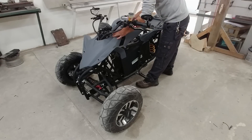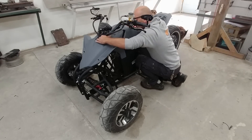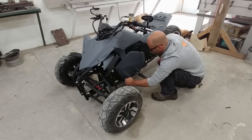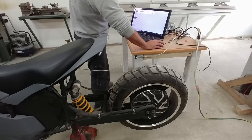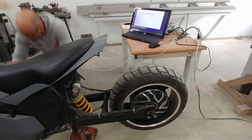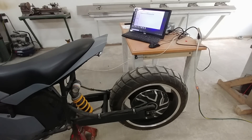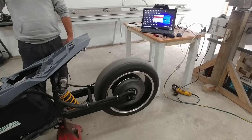The battery that I used is a 72 volt 60 amp hour pack built with LiPo pouch cells. It was custom built specifically for this trike by Gripow and provided for promotional purposes in the original video. Gripow is a leading manufacturer of lithium cells and lithium batteries. Unfortunately they don't sell directly to the general public, but if you need a bulk order of custom batteries for a product that you're developing then they're the folks to call. After testing, this battery provided me with up to 100 kilometers of range for trail riding at around 40 to 50 kilometers an hour average speed, and roughly 80 kilometers of range on the asphalt at 70 to 80 kilometers an hour.